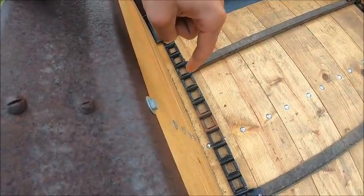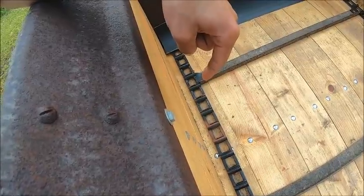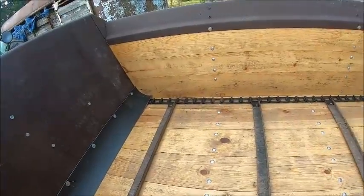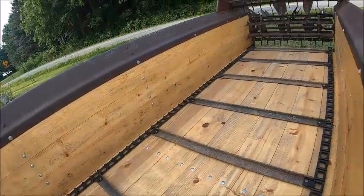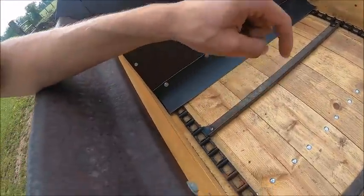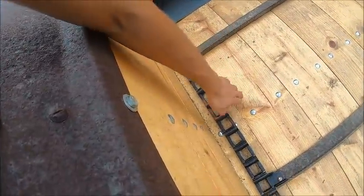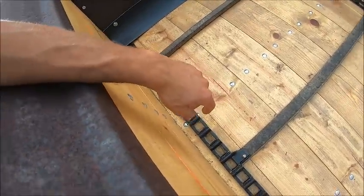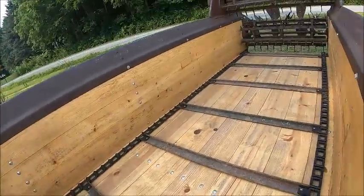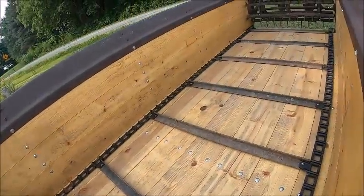Well, the T-bar links are 16,000 pound yield strength, at least according to the chart in the shoot book. This was $80 for a 10-foot roll. T-bar links were $7 a link. And I was looking at like over a grand to put a web chain in this thing, where this one was with the regular chain, the bar links, and the rivets. I have like $430 in this web chain, so yeah, a little bit of a difference.